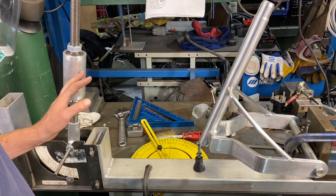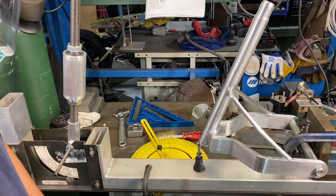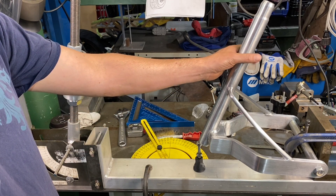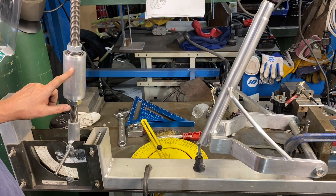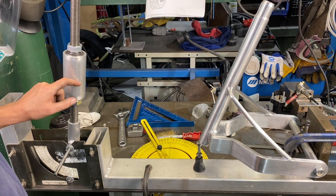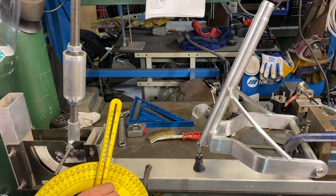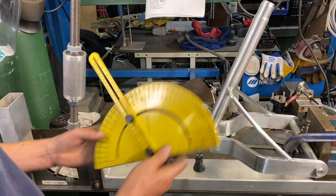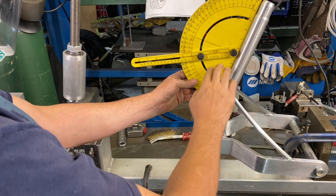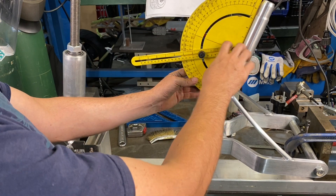To tie in the back with the front, I'm going to be using some two-inch diameter aluminum tube. The tube is going to go around this seat post and into the front headstock — we're going to cope both ends. With my protractor I'll take a look at the angle. I don't necessarily want it to be straight; I want to make it look pretty cool, so I'm going to make this on an angle.